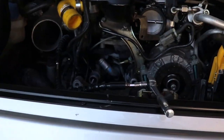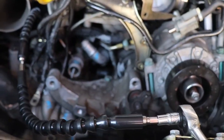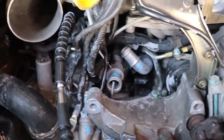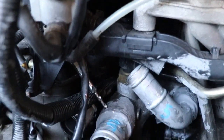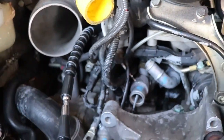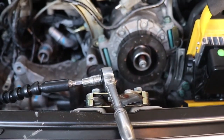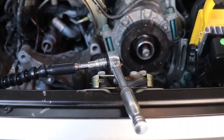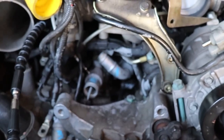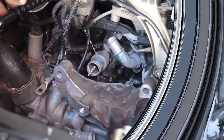Okay, we got our hole drilled, cleaned up, everything all vacuumed out. Pulled our little foam out and took the chips from the inside. Now we have our tap set up the same way, same angle. We're going to use the double flexible extensions here, but I'm going to turn that by hand with the little wrench here, my ratchet here. So I'll set you up on the tripod and you can watch me tap it, but just know that'll be being turned by hand.